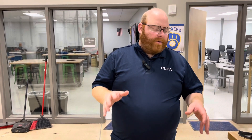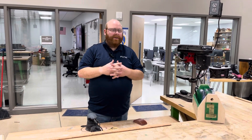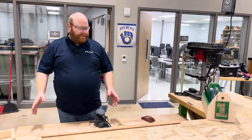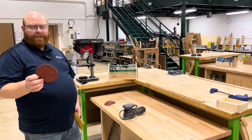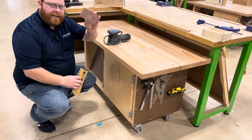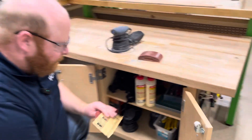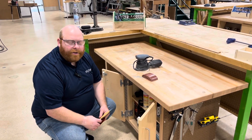A couple of things I want to show you at your workstations are the hand sanding tools you can use on different projects throughout your time here at Fox River. I'm going to show you some of the bigger sanding machines we have that will probably be used more with guidance from myself or Mr. Harris, but we may let some of you use them. First, let's talk about where you can find everything. We have regular sandpaper, 220 and 120 grit for projects. We have sanding discs — hook and loop discs — that you'll use with an orbital sander. All this should be found along with your sanding block and orbital sander inside your station's storage area. If you run out of sandpaper or need more sanding pads, just let us know and we'll get them from the locked supply room.